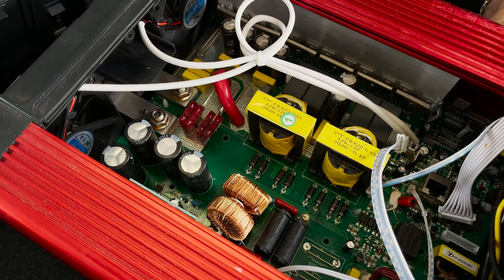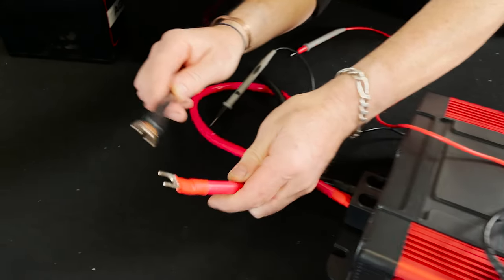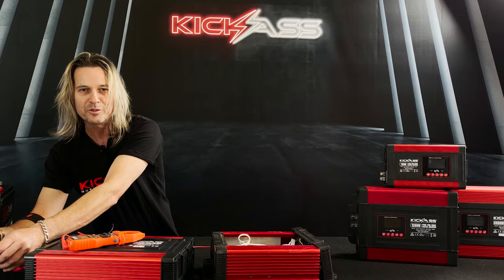That's why you want to be really careful when discharging the inverter. Either let it sit there with the power turned on to drain the voltage over half an hour or so, or you can short the cables out — it won't damage the unit, it just stops you from getting a nasty shock.